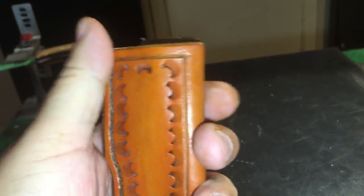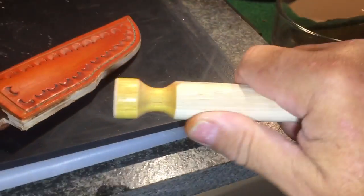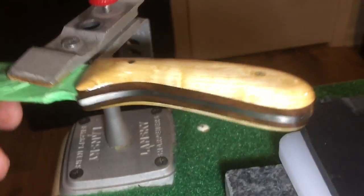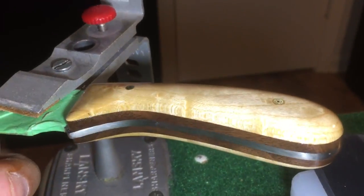Alright, I took it to my shop and put it on a belt sander, smoothed all these edges out — they're all even. Now I wet it and burnish it with a burnishing tool. I've got the last coat of True oil on this — that's five coats. The reason I settle on five is that after five it starts getting cloudy instead of clear and shiny.